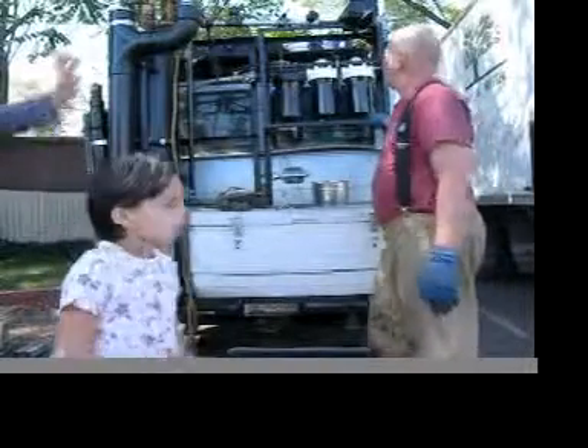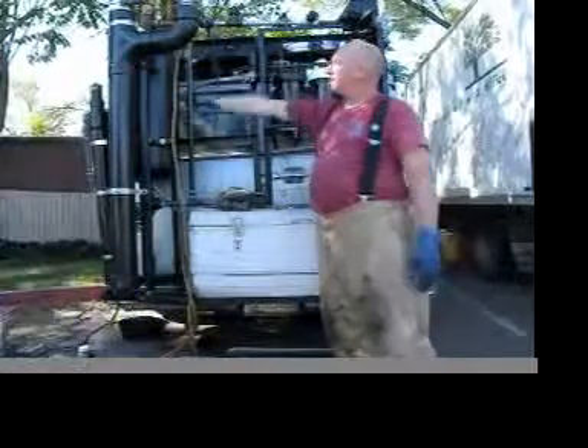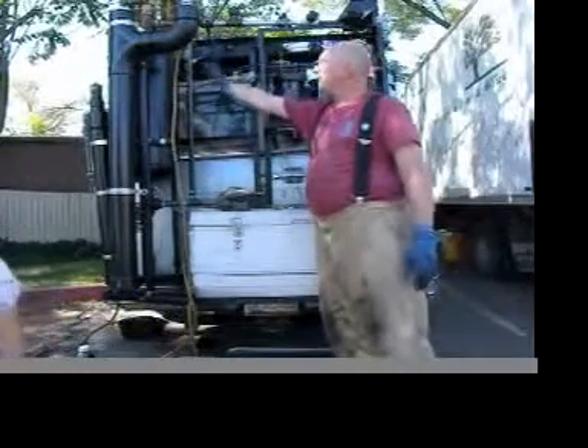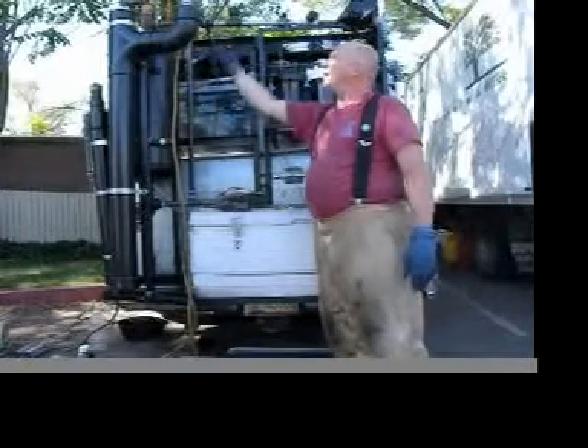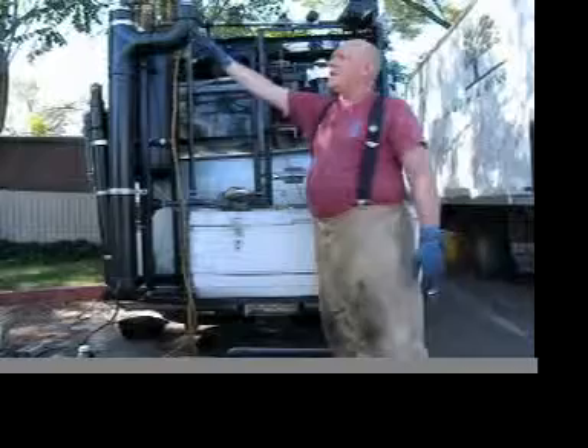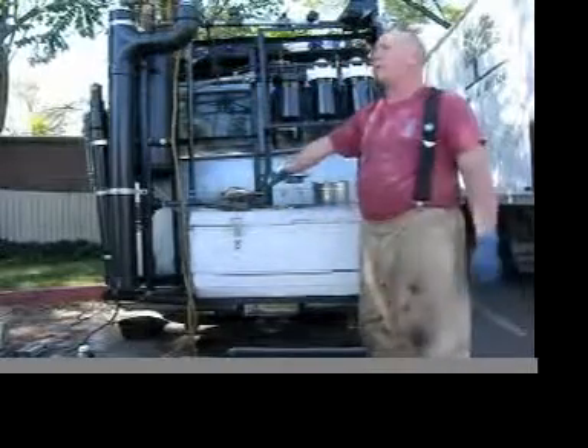So you put something on the bottom to flush it? No, right here — this valve. I open this valve, that connects to this device here. This device is really a copy of the main tank, but instead of holding 20 gallons, it holds three and a half gallons. And three and a half gallons of gasoline is just enough to back flush my whole operation.